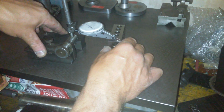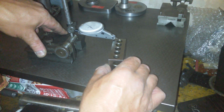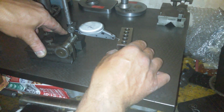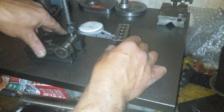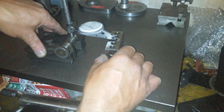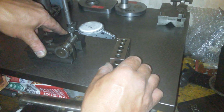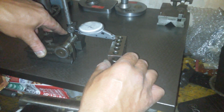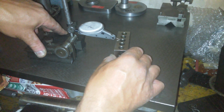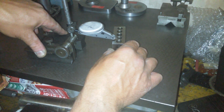Oh no, deviating minus a little bit. Up a little bit. That's 3 thou. Yeah, I think I got something underneath it. And I've fallen off. Right, so we've got nothing, nothing, nothing. That's down a little bit there. Talking a tenth at most. Not even that. These are pretty much perfect. The finish isn't great on them, but they are ground very well.